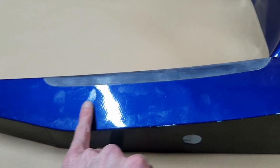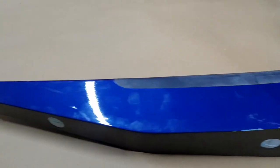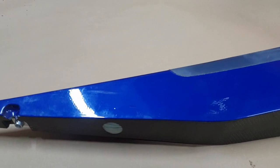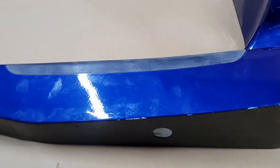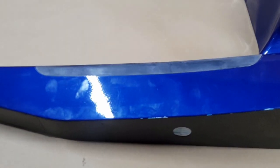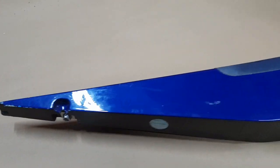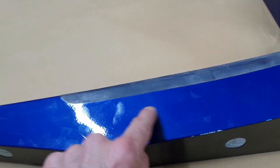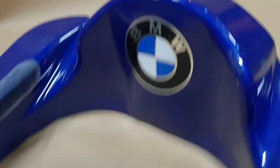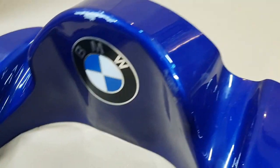So this is actually a really thin fiber. It's like I think 0.3 millimeters thick, and it's used with a different type of resin in the pre-preg, which is almost like a rubber epoxy. It's a general purpose kind of epoxy pre-preg, but before the resin is introduced into the carbon and it's frozen, there's a plasticizer added to it, so it just means that it's very flexible, and also of course it's very thin. Like it's really thin.